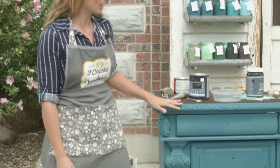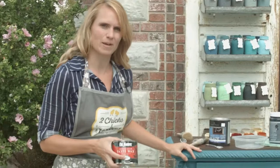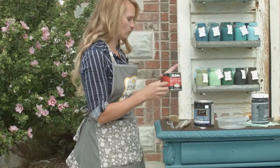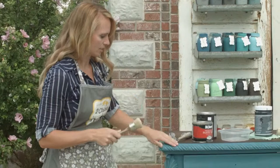I have already painted this whole piece in our Jaded color and I have also waxed it. You do need to seal before you glaze because the glaze has paint in it, so if you don't seal it with either a wax, polyacrylic, or polyurethane, the paint will stick to it and you won't be able to wipe it down. I sealed it with our Old Masters wax, and when I sealed it I just used a wax brush and made sure to get in all the grooves.